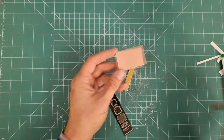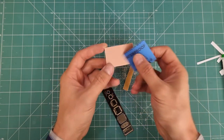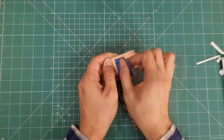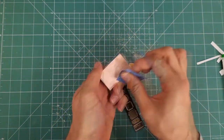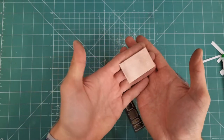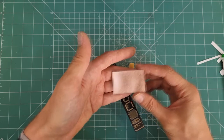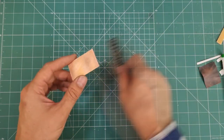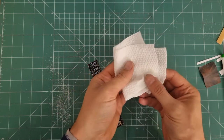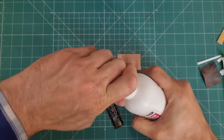The surface of these boards usually is oxidized during storage, and we have to use sandpaper to remove copper oxide from surface of the board to get clean and shining appearance. Then clean surface of board using acetone and a tissue napkin to remove residual particles.